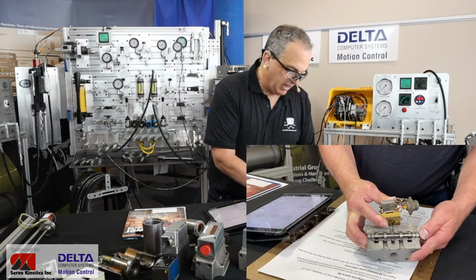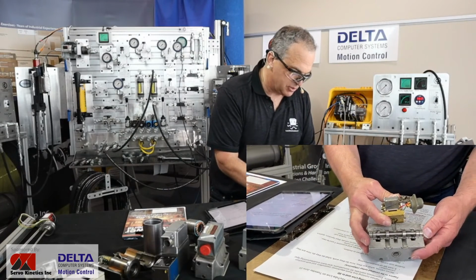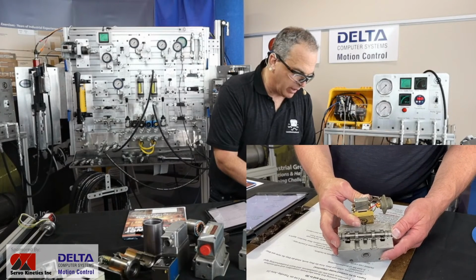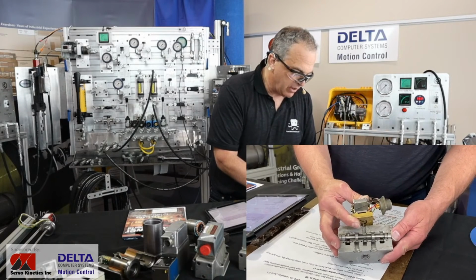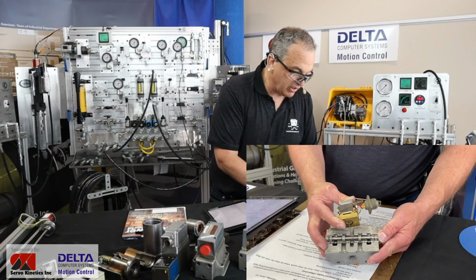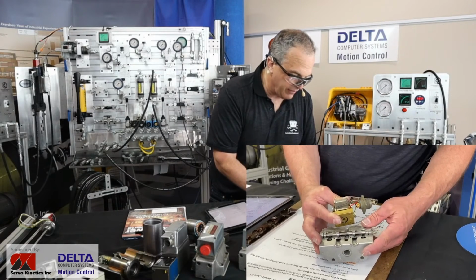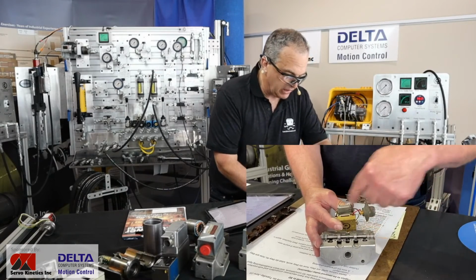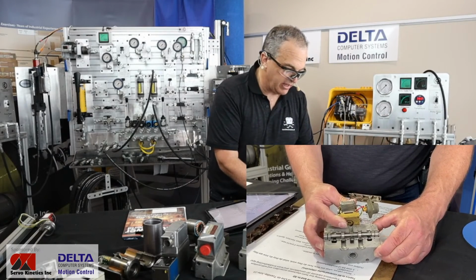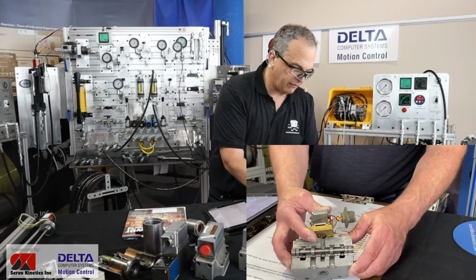And so if it's a slightly higher pressure than on the other side, we may only want the spool to travel part way. As it begins to travel, that feedback wire pulls it away from the nozzle to help us achieve the desired amount of flow opening on that valve. So there's almost a little bit of a closed loop of control just inside the valve itself. Rather ingenious little mechanism, whoever first worked that out.